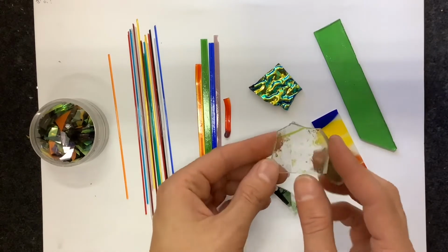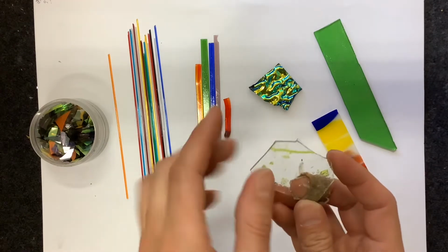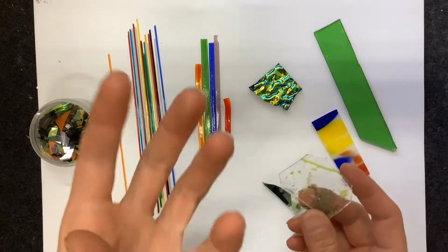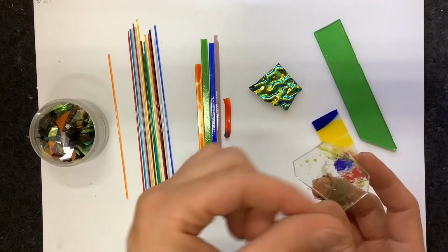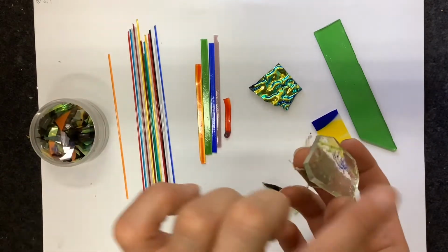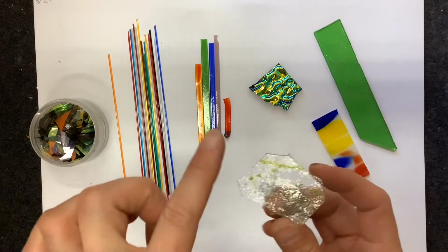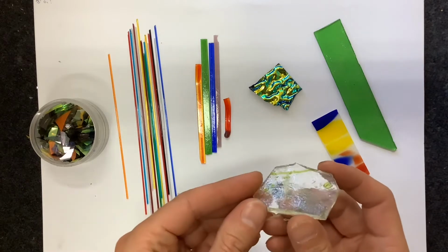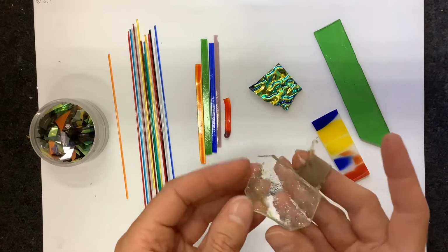Down here we've got some glass that has got some pattern on it. Now these bits here, these are actually called frit. And I don't have any of those to show you, but if you can think of glass that might be crushed up into particles, and then they can come in quite large kind of chunky particles and be kind of slightly finer, and then go even finer again to the last one is kind of like this really fine powder. Okay, all of those are referred to as frit, and they're just kind of given different names for the different particle size. So here we've got where frit has been applied to the glass in the manufacture of the sheet. Okay, and there might have been some stringers involved as well. And then this has been pressed or allowed to cool, and it's got a little bit of texture on one side and it's perfectly flat on the other.